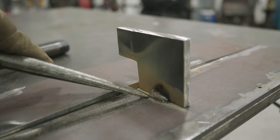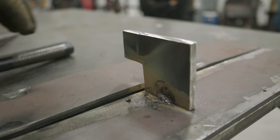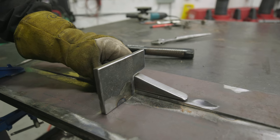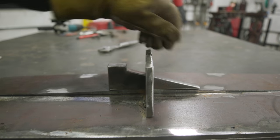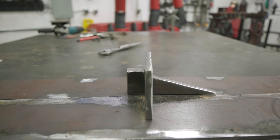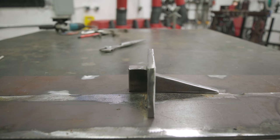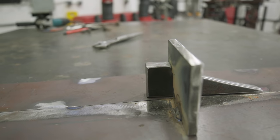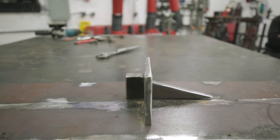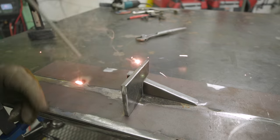I've got about a one-inch tack weld on there — once I'm done I'll be able to break it right off with the crescent wrench. Line everything up; I'm going to bring the wedge in from the same side that I put the tack on and just drive that wedge through. Because the dog and the wedge are the same height, as soon as that little shelf is up against the plate I know I'm exactly flush — right where I want to be. Now I can go ahead and tack these two pieces together and it'll keep that bow from popping back up.